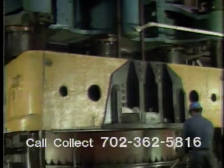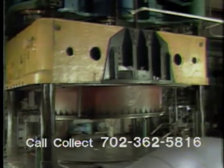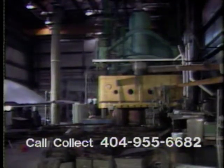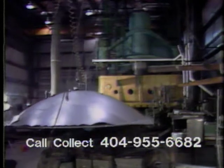After the process during which the dish is formed, excess water is expelled while the majority of the water used in the forming process is recovered and recycled. The press slowly withdraws and permits workmen to remove the completed antenna, inspect it, and continue the water drainage. The 183-pound SS-112 is lifted effortlessly by the vacuum hoist, visually inspected, and moved to the cutting rack, where a workman neatly trims the surplus steel from the edges with a plasma cutter. The dish edges are clean and uniform after that process. The antenna is lifted off the cutting rack and swung over toward the finished stack. Once again, a visual inspection takes place. Workmen know that because the machine die is extremely accurate, thousands of dishes can be turned out with that same high quality.